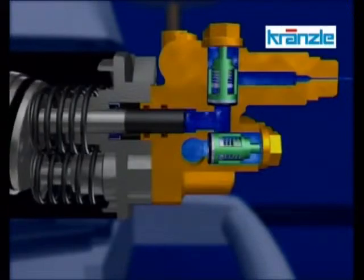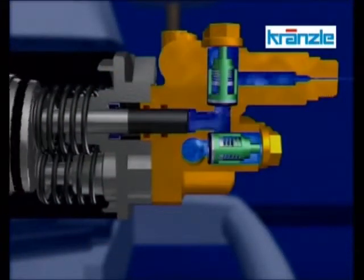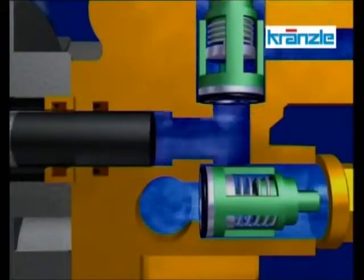This opens and closes the valves. This is a real view of a valve from inside a running high pressure cleaner after starting up the machine. The three suction valves are at the bottom and the three pressure valves at the top. In the pump room, the plungers press the water through the high pressure hose and out of the nozzle.